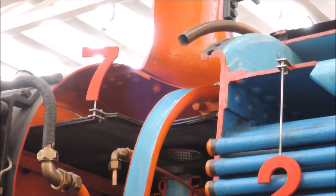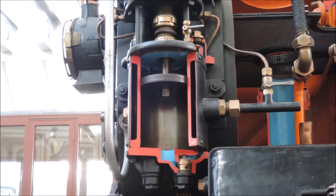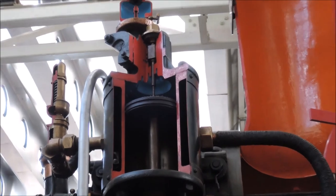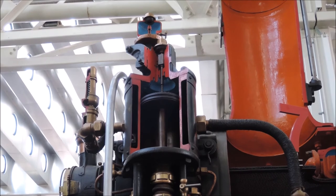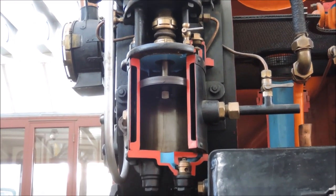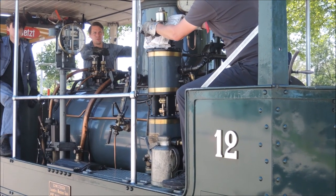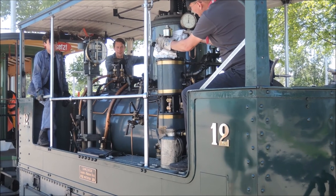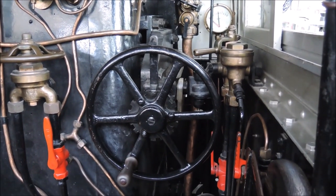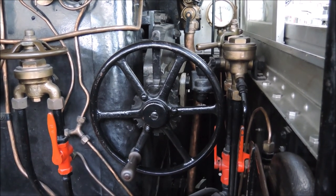The last thing we are discussing in detail is the air compressor. Compressed air is required for the brakes and is produced with a simplex compressor — a single-cylinder free-piston engine, which basically means a crankless steam engine with the compressor piston directly attached to the steam piston. It doesn't need any valve gear because the engine is single-acting: the steam pressure only pushes it in one direction, and then it is pushed back by the air pressure in the compressor cylinder. Because it is a single cylinder it is not self-starting, unlike the related duplex pump. That's why the compressor has to be started manually and keeps idling when the air bottles are full, causing one of the typical steam locomotive sounds. When filling up the empty air bottles after braking, it pumps much quicker. The two brass levers on the footplate next to the valve gear wheel are the valves for controlling the two different brakes — one for the locomotive and one for the train behind.